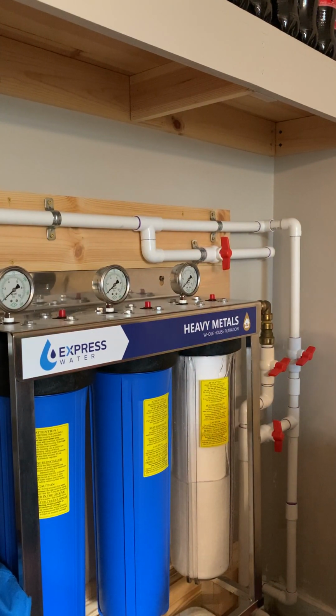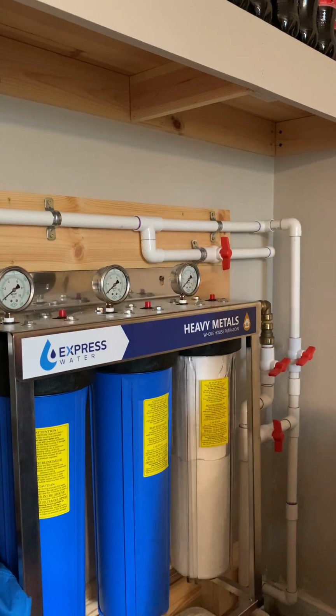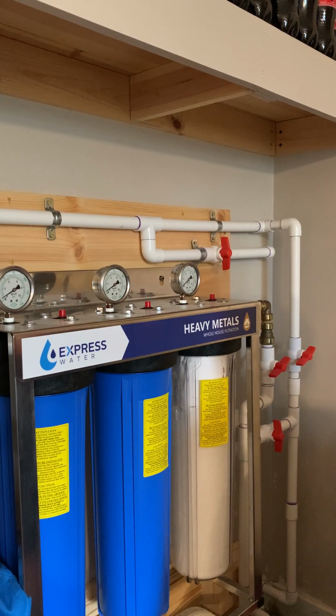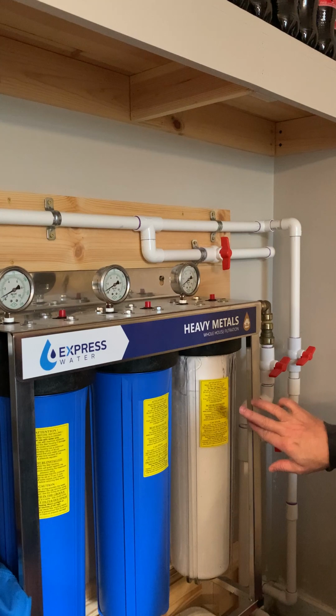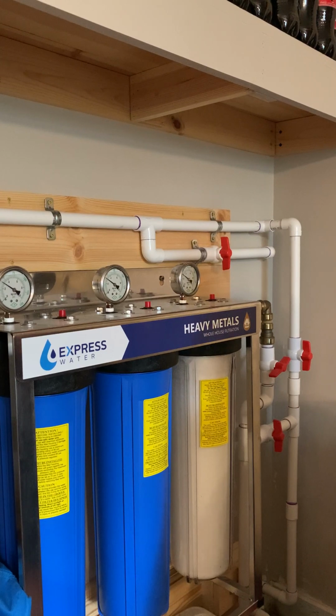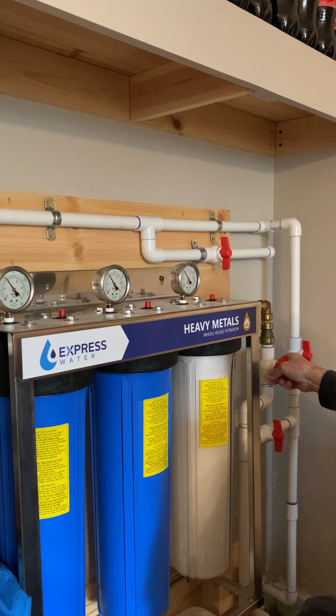And of course, you know, the biggie is leaks. Trying to get your hands around the ring here. Hopefully you can see the gauges building up. Open up the outlet all the way to the sink upstairs. Obviously there's going to be some air that's going to kind of burp through. I'm going to slowly bring it up to full pressure.